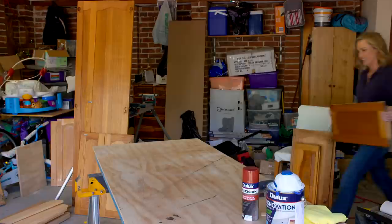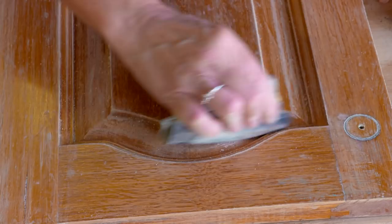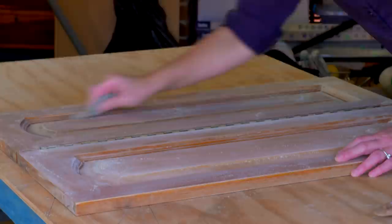If you don't love your kitchen cupboard doors, why not paint them? It's a pretty easy job and I find it easier if they're outside away from the cabinet, laid out flat. These ones are solid timber — all they need is a light sand just to go through the varnish, which scratches it up and helps the primer and paint to stick. Make sure they're dust-free before you go on with the painting.